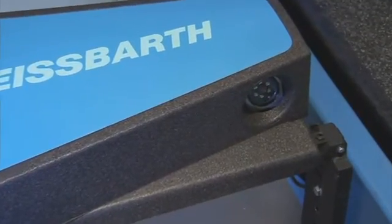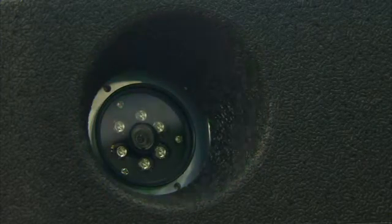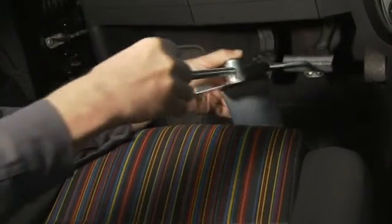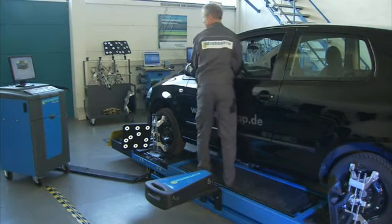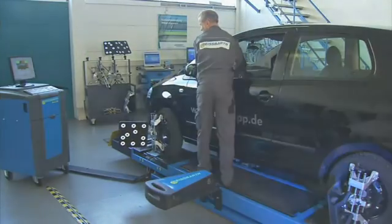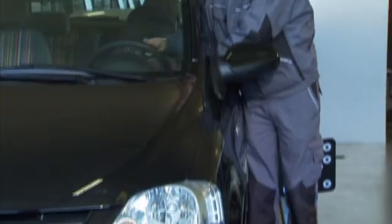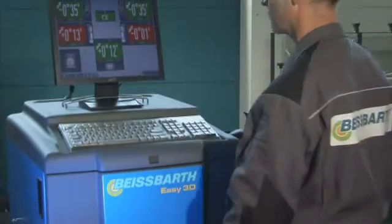Maximum technical performance and precision is guaranteed by our Precision CCD cameras as well as the innovative reference system. The brake lock is subsequently applied in order to measure caster and KPI. The mechanic undertakes a 20 degree left-right steering lock angle. The EZ3D integrated reference system makes fixed installation of the sensors and calibration to a position unnecessary. The integrated camber and KPI pendulum ensures absolute reference to gravity — a decisive factor for high levels of reproducibility in terms of measured values.